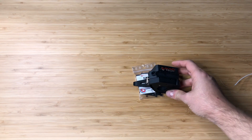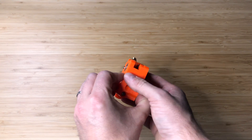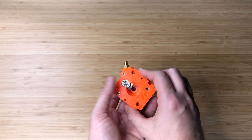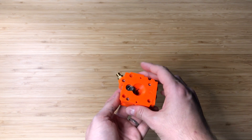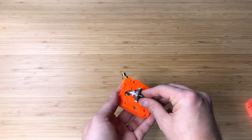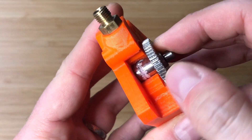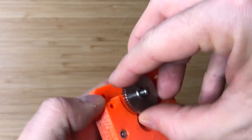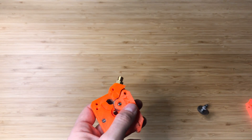That's it for the unboxing part. This is the extruder from the original Prusa Mini. I'm not covering how to remove it from the machine since I have another video for that, which also explains how to remove a clog — link below. I'm going to share why I think this is an inferior design, even if it is pretty clever from Prusa. The problem is that you have basically a hob with teeth to drag the filament, and that acts directly against this bearing.